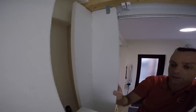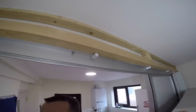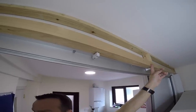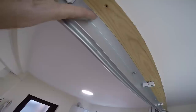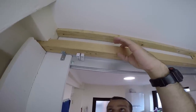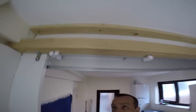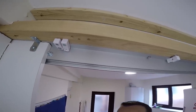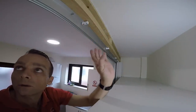Now I'm going to show you how it looks inside. This is the inner frame on the side - you can see how it is connected. This is MDF material all around. This is the bottom and on the top there are two wooden panels connected together in the middle, and that one is fixed to the wall. This is the main one which is holding the whole frame. This one coming on top - when you build it into the wall roof, here I didn't have where to go because the panel is thicker. So if I go on top of it with the frame, it wouldn't match the size of the hinges. What I did - I went under. But the challenge was if it's going to be strong enough to hold the weight of the doors. I didn't want to move this panel a bit lower because it was already solidly fixed on the wall.